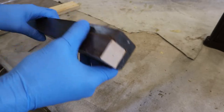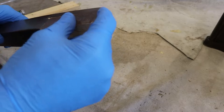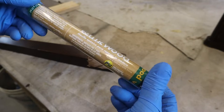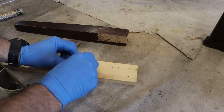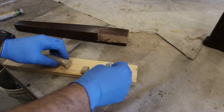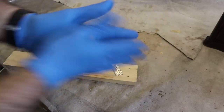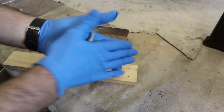We check to make sure we have good tight seams all the way around where that block fits. We need to fill the seams so that we don't have any cracks showing. The product we like to use is called Quickwood — you can find this online or at Home Depot. It's an excellent filler, very strong, with excellent adhesive properties. You use a box cutter blade to cut off the amount you need. It has two different colors — it's like an epoxy, with a center color and an exterior color. You need to knead those together, and rolling it like a snake and then back into a ball is one of the fastest ways to mix it, since it can be stiff at first.